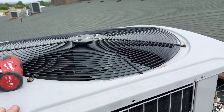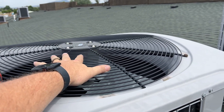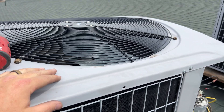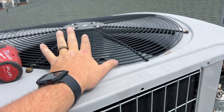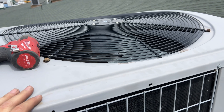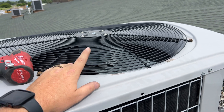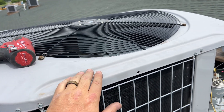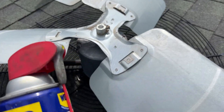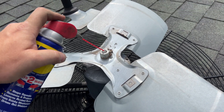There's the lazy way and the proper way — I'm doing the lazy way because it's hot out here. We're going to take the cage off and pull the motor out, rather than removing the entire lid. When you do it this way, be very careful not to get the blades caught on the edges because you can bend them. We'll spray a little WD-40 on here, and hopefully we won't need a fan puller.